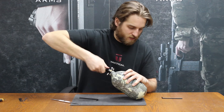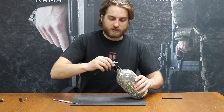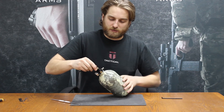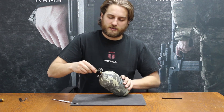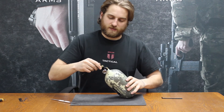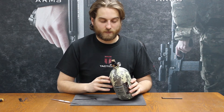I'm going to get that about as far as I can make it go with my fingers, and then go back to my 3/16ths. I recommend spinning the tank because I want to keep that thing depressed — I don't want to strip out the brass of that top flange. And again, good finger snug. And that is the internals of the Mith regulators.